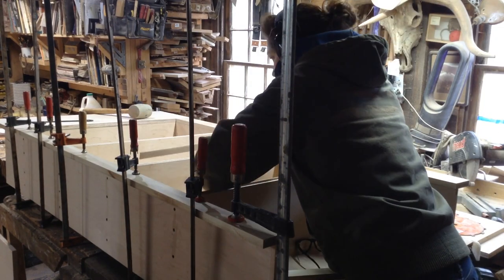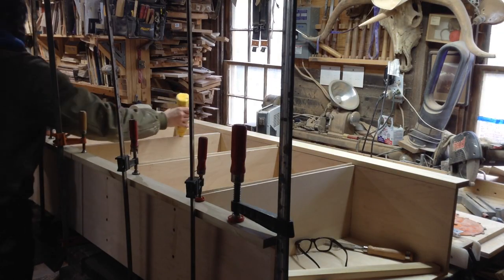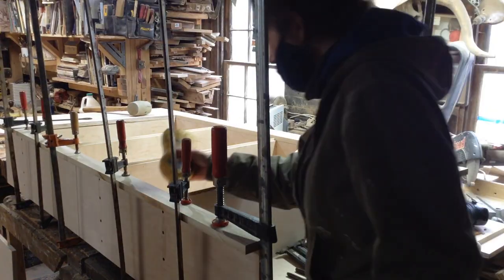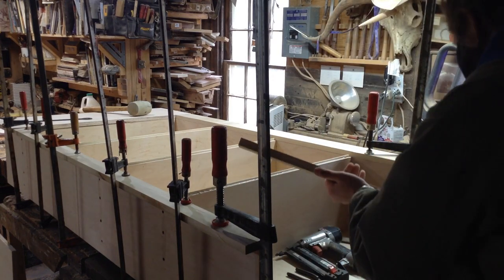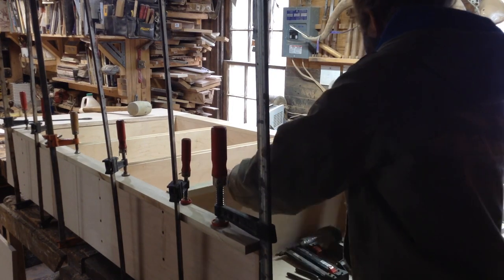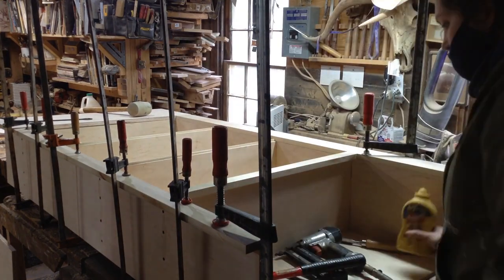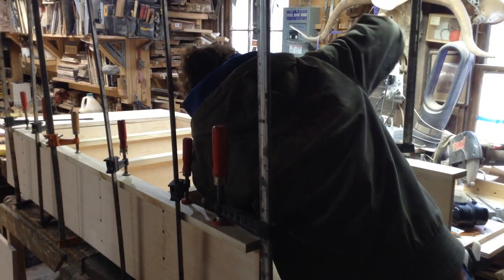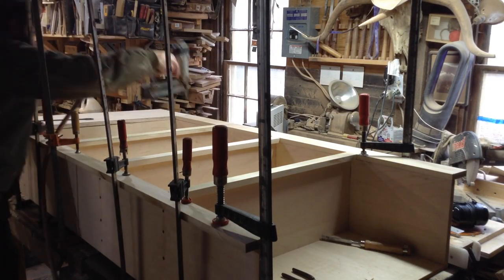With that in place, I can then go through and add all of my rails going across the bookcase. Because I'm not going to be gluing the edge of the rails to that removable stile, otherwise it won't be able to come apart. But it's just a matter of putting some glue on there, hammering everything into place, because these are a nice tight fit, which is what I wanted. And then I will sink some brads into these as well. Since this is going to be painted, putting hardware like this in there is pretty easy, because all I have to do is put some putty on there, and you'll never even be able to tell that there was anything there.